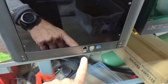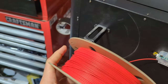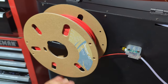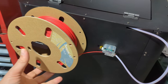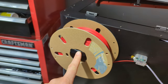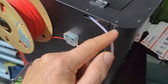You have connection ports down here for ethernet, though I just run it off WiFi, plus USB ports. The only other assembly is the filament spool holder. It's a bit basic — ends up scratching the frame a little, and I find it sits a bit too low. The filament off the spool kind of goes directly into the runout detector at an awkward angle. I think that's one adjustment they should make, and I may design a new holder.